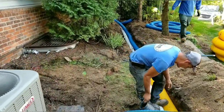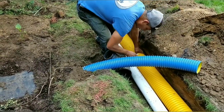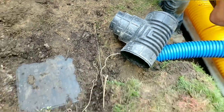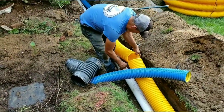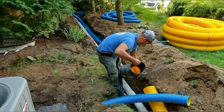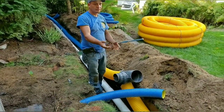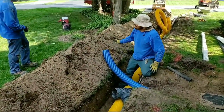So we got these reducing tees, so they're really nice. It's a 6-inch main, and then the fact that you can do 4, 5, or 6-inch, very cool. So the way you see it right now, being used, that reducing tee fitting, that's how we typically use it. See, that's beautiful right there, man, I love it. So that drop literally falls into the Baughman 6-inch virgin yellow.